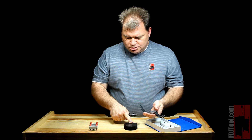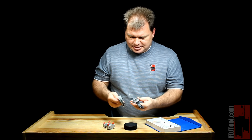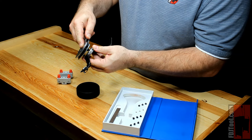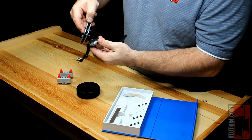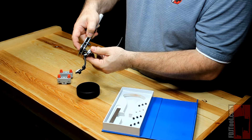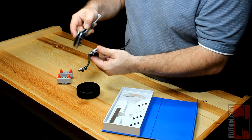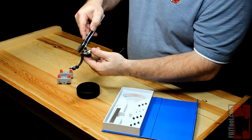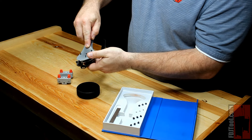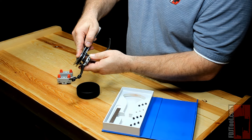You can do this by hand, use a watch pad, or even use a watch clamp to hold the case. I'm going to line up everything by hand first so I know everything's going to be in place. I've got my first two pins about three centimeters apart and they line up pretty well with the notches. Without making contact at the back with the third pin, I'll put my first two pins in place and rotate the thumb screw just a little bit so they have a fairly firm grip — but not too firm — on those two notches. Now I'm going to see how far away the third pin is from the third notch. I need to come in a little bit more.